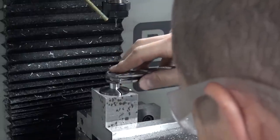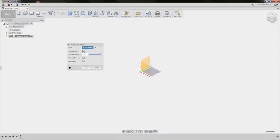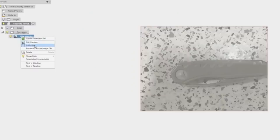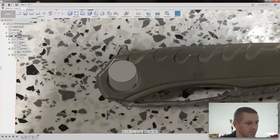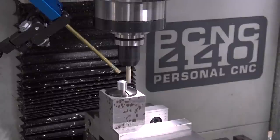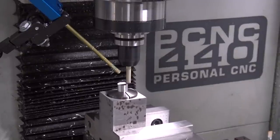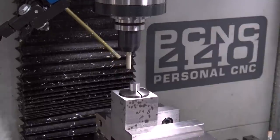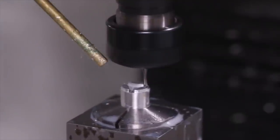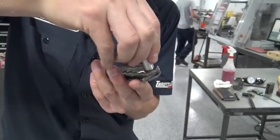In the first video, we made a knife security tool. We took a photo of the part, brought that photo into Fusion 360, used the calibrate function on a canvas to build a solid model of it. We had a piece of half inch round bar, and one of the best ways to hold round material, especially when it's one inch or under, for any machine operation is a 5C collet with a 5C collet block. Here we used that collet block in the 440 to hold the piece of stock upright and machine the profile of that knife security tool into the part.